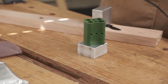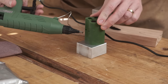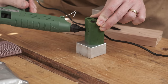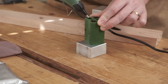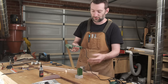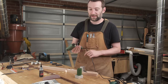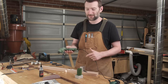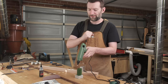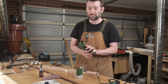Now the problem is I haven't used up all the sticks — you're supposed to reseal these. So the kit I bought came with what they call a knot filler saver tool. It's a silicone mould for purging basically, so you just fill that up and use it all until it won't go anywhere. That should cool down in half an hour or so. The downside is there's still some left in the gun that you can't push all the way out, so there's going to be some loss. If I needed to change colour I'd just ram in another colour and purge it until it was running the new colour. I'm mostly going to be using black filler for knots and sap veins, so it's not a huge deal for me.